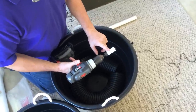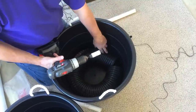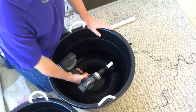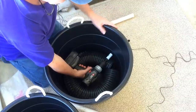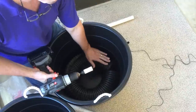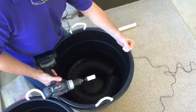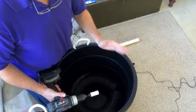We have our 25-millimeter or 1-inch hole saw. You could measure up from the outside approximately 5 and 3/4 inches — that's a good place for the drain line to be with this 4-inch pipe. However, what we found is a lot easier: we just set it right on top of the pipe once it's sitting in the tub and drill through there, so it's exactly where we want it. We want it above the pipe so that becomes the reservoir for holding water, and anything above that level goes out the drain. We also like having our drain and fill near each other — as you're filling it, when it starts to overflow you know it's full, right there without having to look over the top.